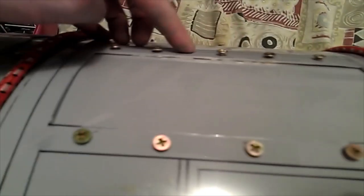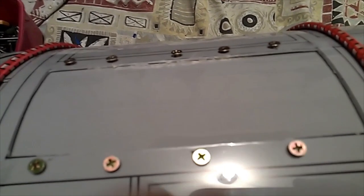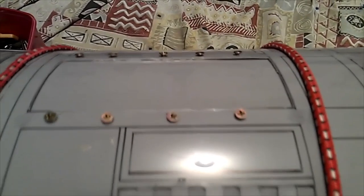Now, you've got wood all the way around the outside and down that seam, but you haven't got wood everywhere else. The beauty of having the inner skin here being 1.5mm thick, the same as this, is if you get a small drill bit, like that one, and just pilot drill through the plastic where it bubbles up, some spots are bubbled up, then you can just run some screws down to hold it in place until the glue dries. If it turns out you want to leave them there, you can take them out, countersink them and put them back in because they'll tap their way in. Just go slow with the drill so you don't burn a hole or break it and split it.